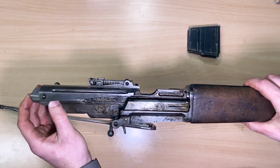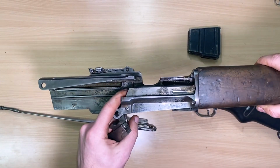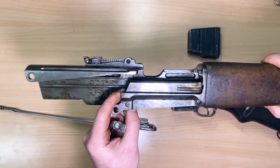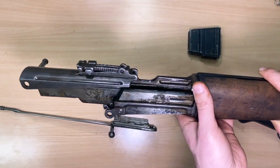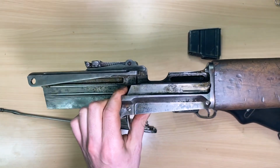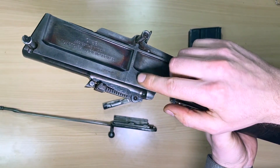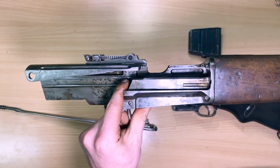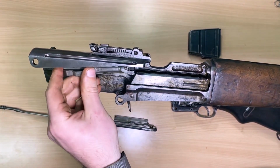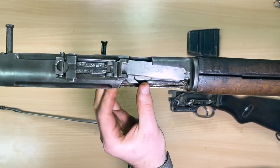So this edge locks here into this recess, and to extend the lifetime of the gun, actually this part, which is probably under the most pressure during the locking and unlocking, is replaceable. You just unscrew this bolt and screw a new part right here where the bolt locks, which definitely helps a lot.